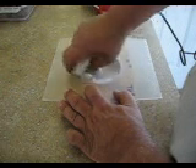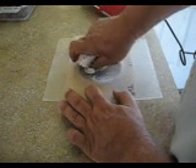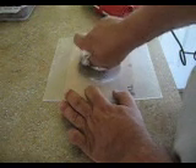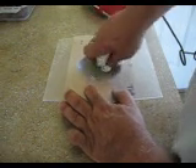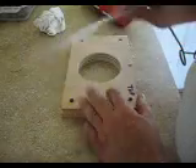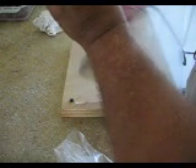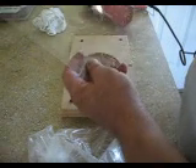It's very important to leave the masking on. Let's say that's close enough right here. Pull the masking away from both sides to see the result. Now I can just draw out my circle and trim it with a pair of sheet metal shears.